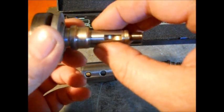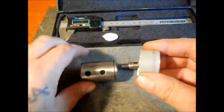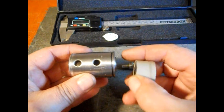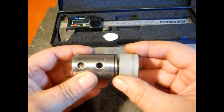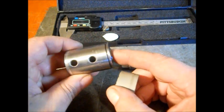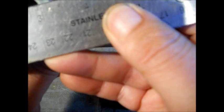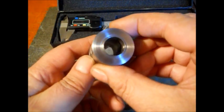We're going to use this to our advantage and chuck it in the lathe because we have to take down this diameter. This was a coupler that came off something like a pressure washer — it has a 5/8 shaft. I started cutting it here and decided to make it a little longer. We left a little shoulder because we had it in the lathe with an improvised tailstock piece so it didn't wobble. It's actually too big — about 1.25 inches — for the small lathe, so we ran it at a pretty low speed and slowly sped it up.